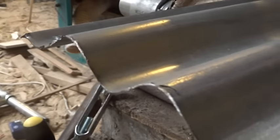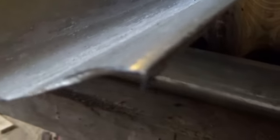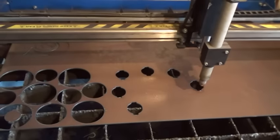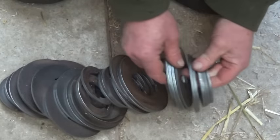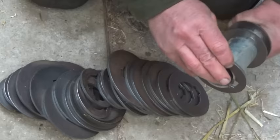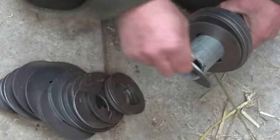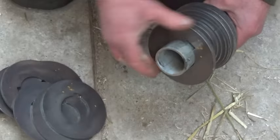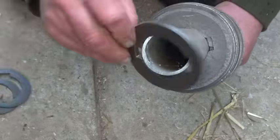Well, steel sheet, but they call it corrugated iron, so anyway. My first attempt was to make lots of doughnuts out of 4mm steel. My thinking was that if I measured everything carefully, they should stack together in the right shape. It wasn't a bad plan exactly, once I'd figured out how to key them to the shaft without any welding, which would have deformed the pipe. But I gave up on it when I realised I'd need about 400 of these discs — the weight and the cost would have been huge.